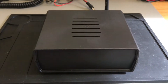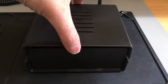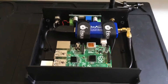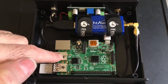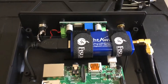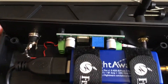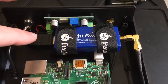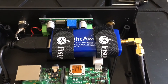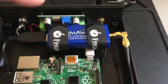We're back with part two. Taking the lid off, this is what's inside. We've got a Raspberry Pi — I'm using an old Pi 2, which is why I've got the dongle in there. Around the back is the power input with a diode on it, and there's a buck converter to drive the display. Then there is the ADS-B dongle — you can use various dongles; this is just the RTL-SDR dongle.